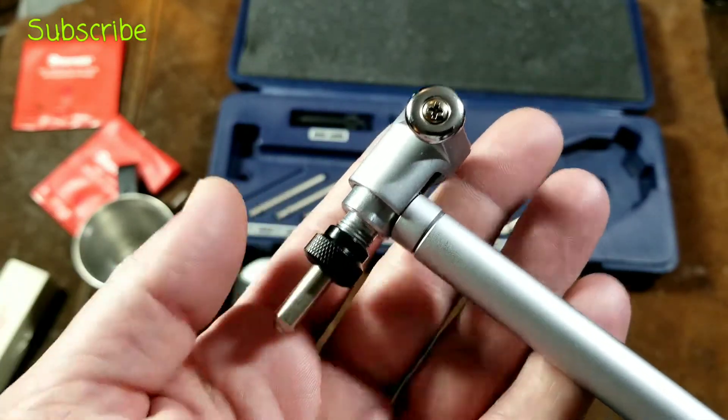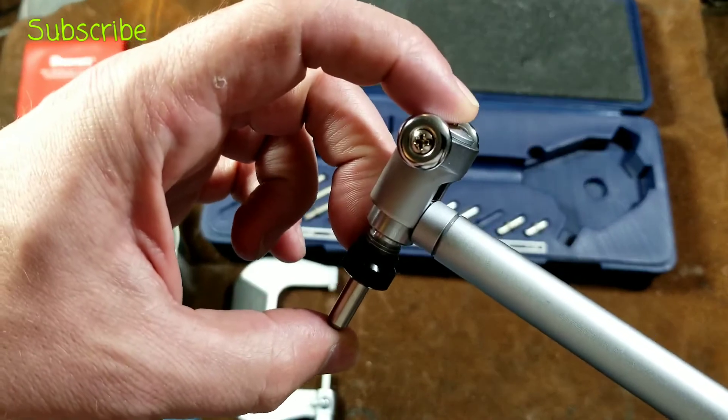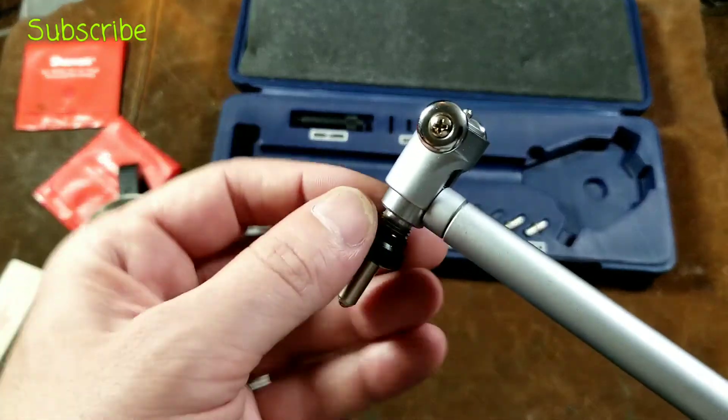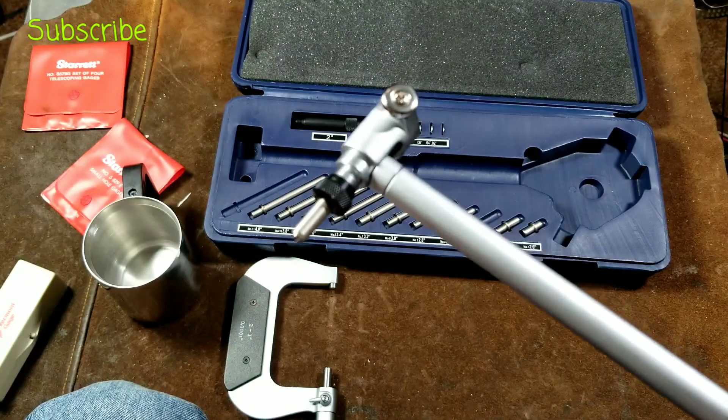Where with this gauge, even if there's a piece of grit, you're actually using a micrometer or something else to actually zero it. So you'll end up zeroing the piece of grit as well and still get an accurate measurement. And that is another distinct advantage.